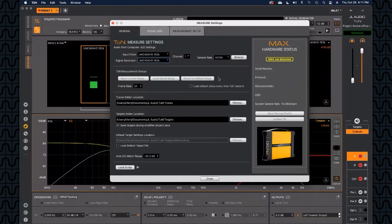And what Rob was saying is a really good point. You can use the computer's audio out. Just use the headphone out to RCA or even aux to aux and go directly into your system under measurement. Obviously, most of you guys are probably mobile audio, but you can send the signal to any audio system to measure. Yep, absolutely.